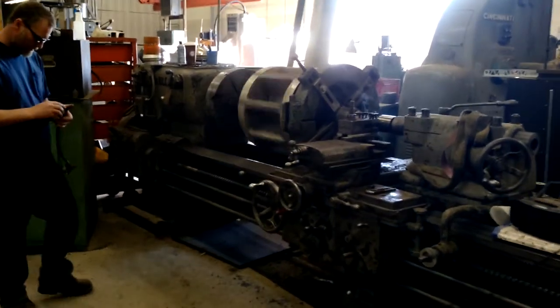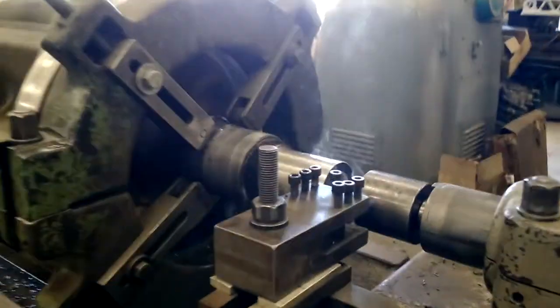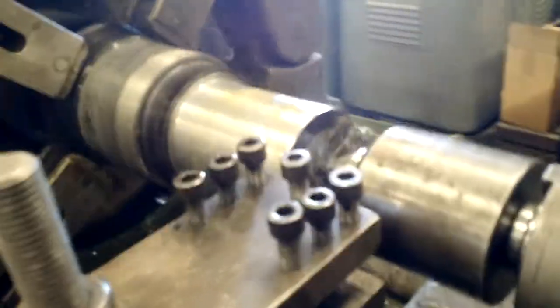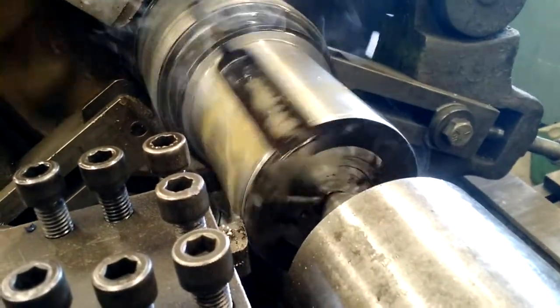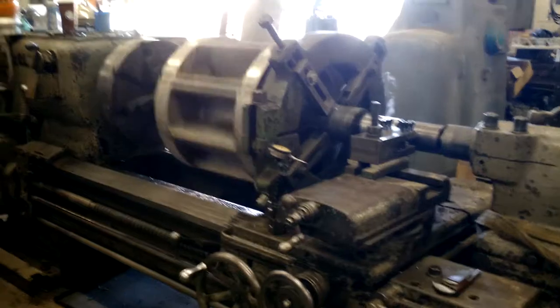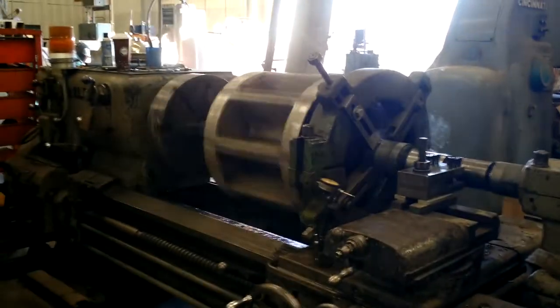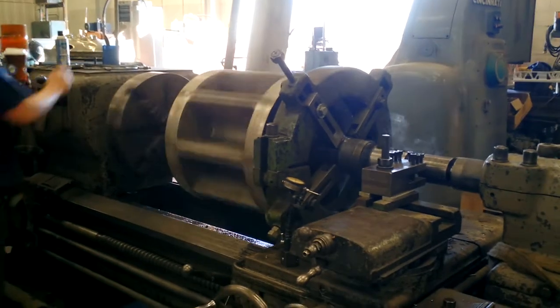Let's take a closer look at this. So this valve rotor had two ends. The customer only used one end to drive from, and the other end was destroyed. We've got that in the chuck. And it was more cost-effective simply to turn down the larger ends, since they're only driving from one side anyway.